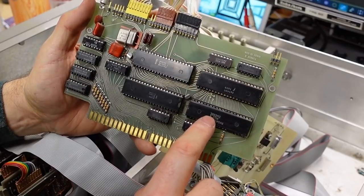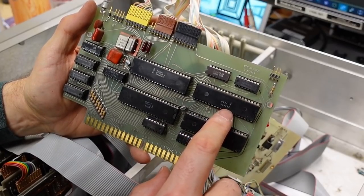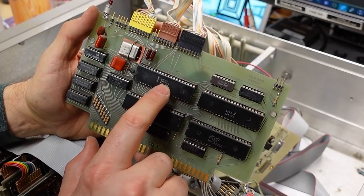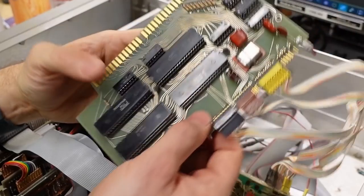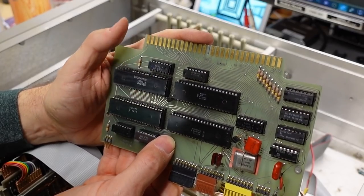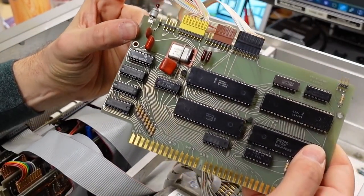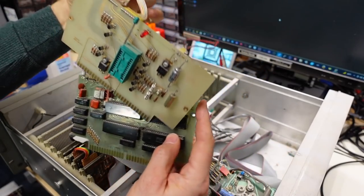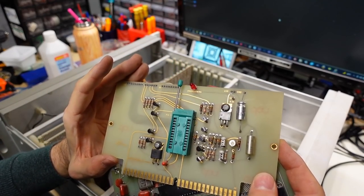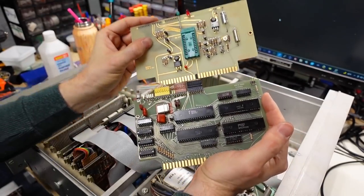Let's look at what I think the EEPROM programmer connects to. 3852PC — the notch is on that side, and this has the notch on that side. 3854PC as well. I don't even know what these are. MOSTEK MK3850 and MK90071P with some support logic. There's a button right there, and cables run over to this board. There's an LED right here and underneath it says 'programming.' Oh look — address lines, data lines. So yes, definitely this is an EEPROM programmer. Wow, fascinating.